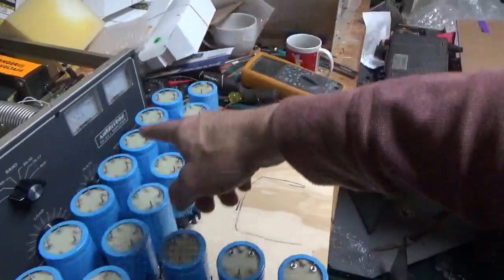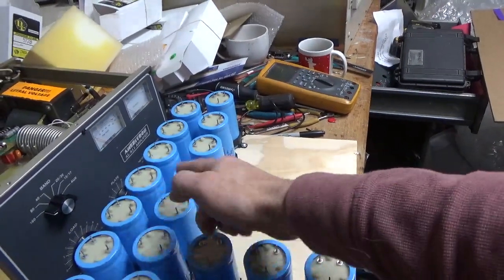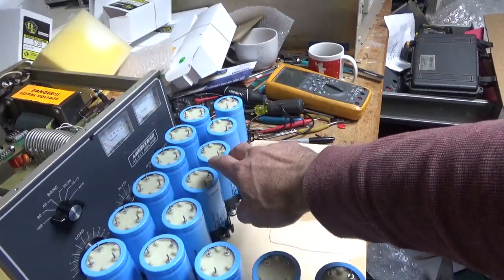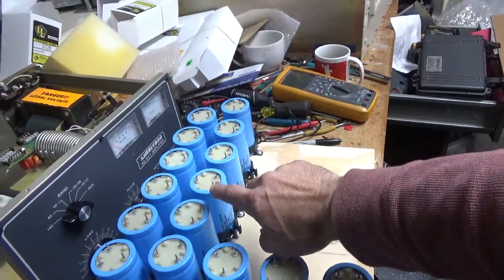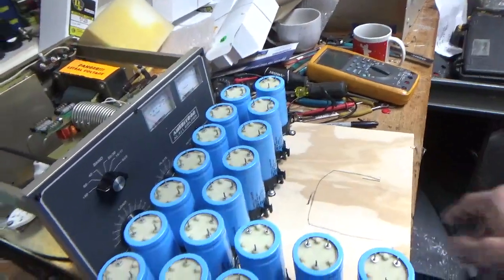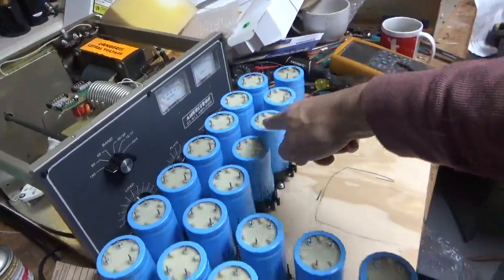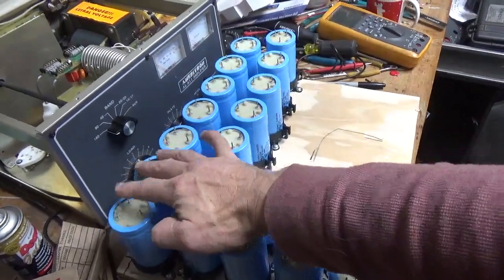The screws do not go all the way through the wood. These clamps are plastic. So they're all in series. I'll put a 100k 3-watt resistor across the H1 and then connect them each one to the other with silver-plated, stranded, teflon-coated wire. Short loop. The positive is here, starts here, and goes around. And then the negative — right there is a positive-negative.